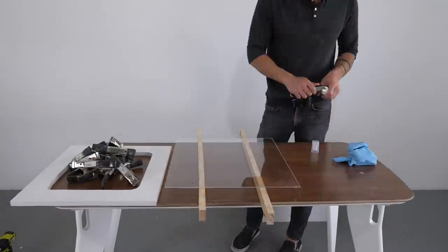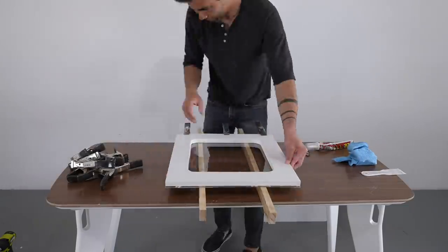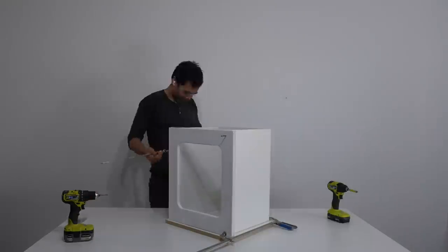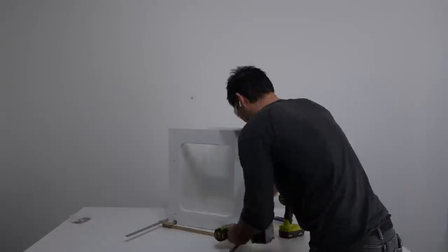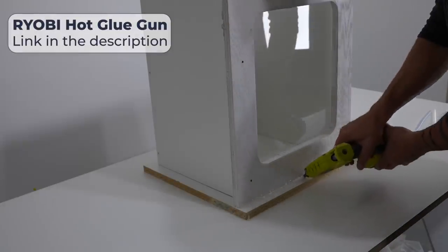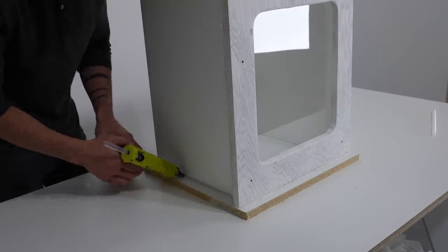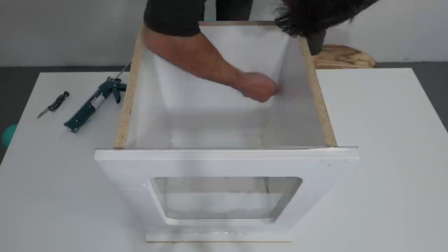I peeled off the protective lining and then glued the plexiglass to the plywood frame. I screwed on this window side and then placed this four-sided box on a melamine base and started sealing up the edges with hot glue. I find hot glue is sufficient for attaching the base of molds like this, and it's easier than driving in screws perfectly. I sealed up the insides of the mold with silicone.